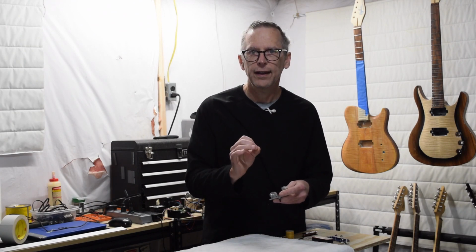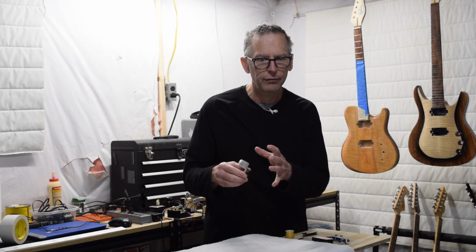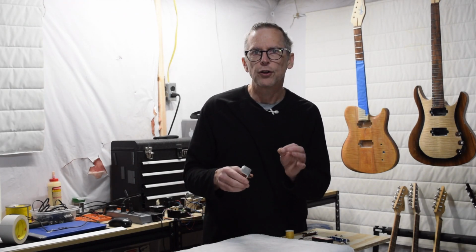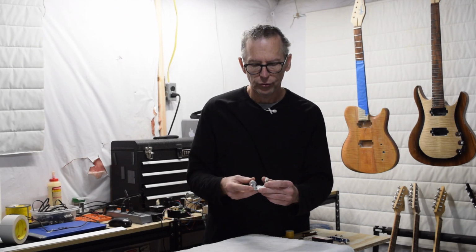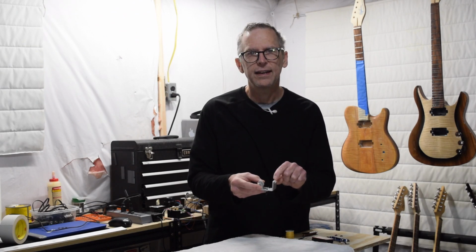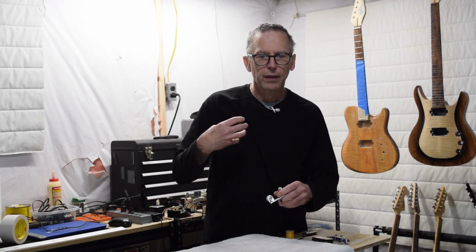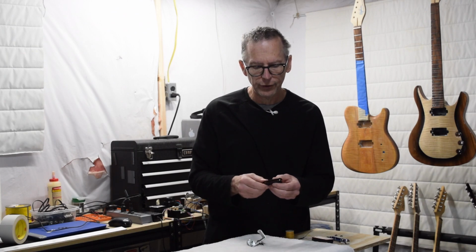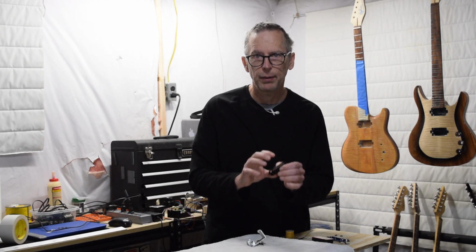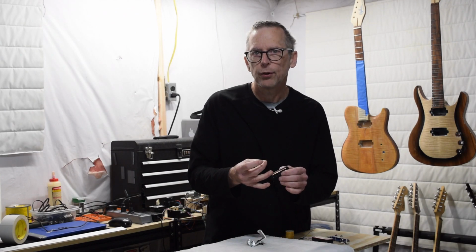So you have to put a little bit of tension on it, and that will help the wire wrap around the core tightly. There are a couple of considerations when you're applying tension. One is you want to have that tension to keep the wire seated in the guide as it's traversing. The other thing is you want to apply tension so that when the coil is finished wrapping around the bobbin, the coil is tight to the bobbin's core. If it's loose, the wire can vibrate.